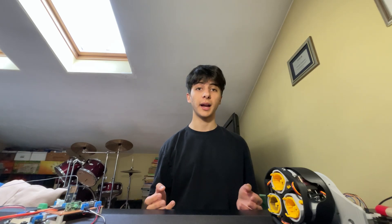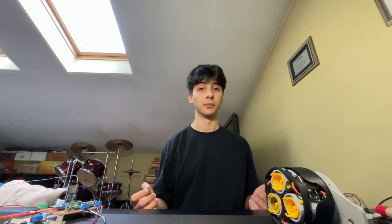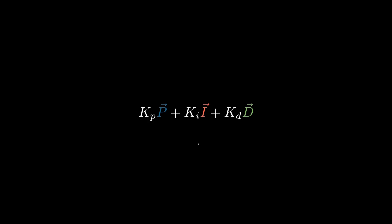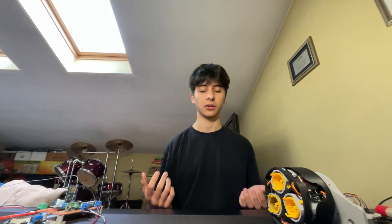To find the required torque, I use the PID controller algorithm, where to achieve stabilization you combine a proportional, integral, and derivative part of the error with respect to the wanted state — in my case the rocket in a vertical still position. These three components take the shape of angular accelerations, since that's how I can act on my rocket.